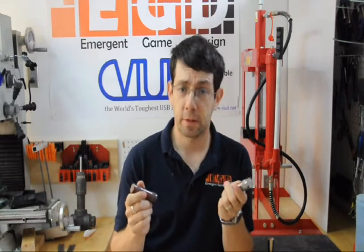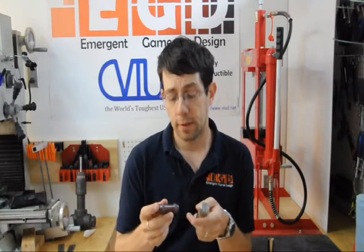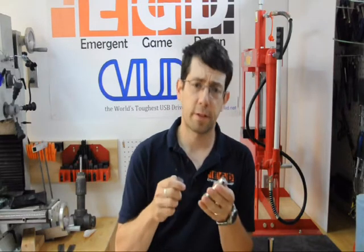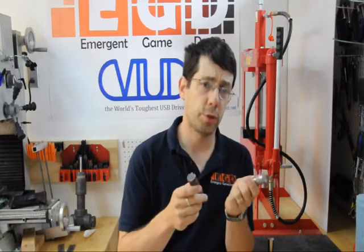I just finished shock testing the Vayu. I did 10 different runs at various speeds and targets. The good news is the aluminum one survived up to 2,500 G's and the titanium one up to 2,200 G's. The bad news is that both eventually failed — the USBs in them no longer work. The aluminum one failed past 2,800 G's and the titanium one past 2,500 G's. That gives us a good range, and if we choose a shock rating of 1,000 G's, that gives us a very comfortable 2.5 times safety factor.